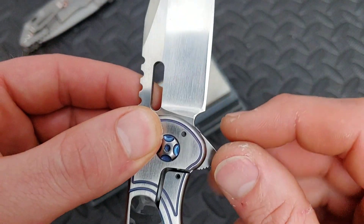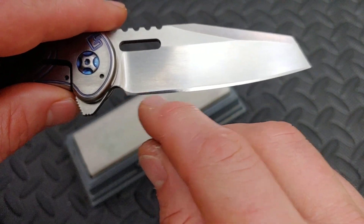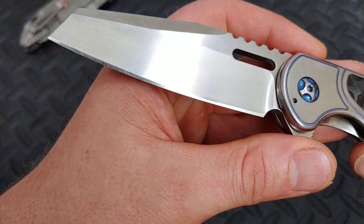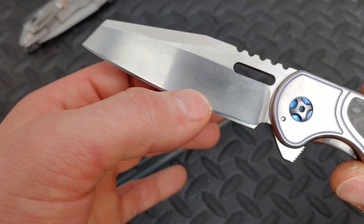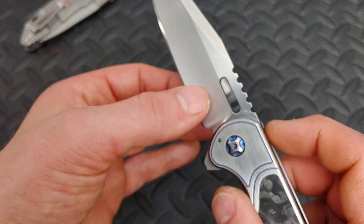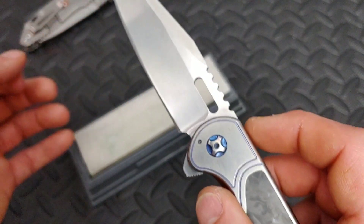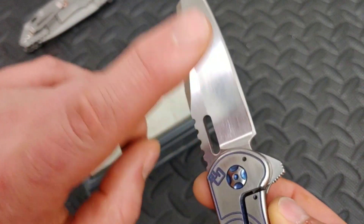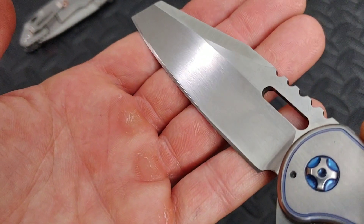The plunge grind is farther up the blade on one side, and you can see how the edge kind of swirls — that's different thicknesses on this side. This side was done fairly well compared to the other side, but you can still see it's a little thinner here and then a little thicker. Sometimes that's typical for a taper. But where it becomes an issue when sharpening is when this side's thinner then gets thicker, and the other side is the opposite — so you have one edge that looks like a wave and the other side is perfectly straight.